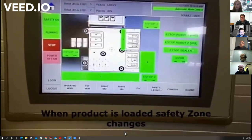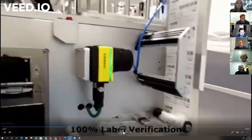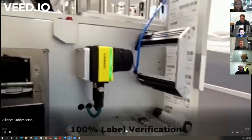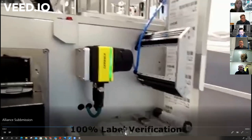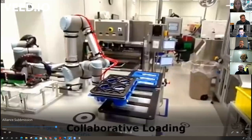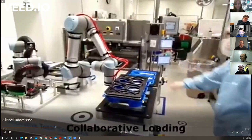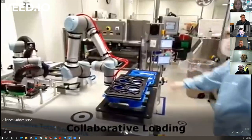We have also then had to certify the cobot has got a force function which will stop if something comes underneath of it. And with what we've used, it's an E-Series Universal Robot that we've been able to test the force applied before it hurts. And we've certified that the end of arm tool that's shown here, so this is all smooth on the underside. So if a person puts a hand in, it will pinch, but it won't burst skin. And that there's a force that's acceptable. So we'll leave it drive on.